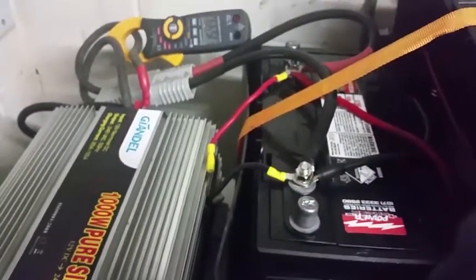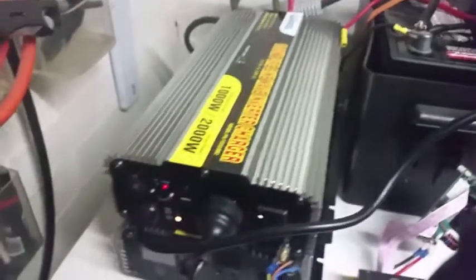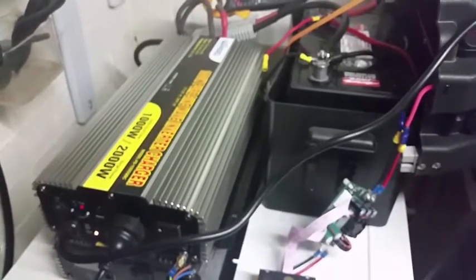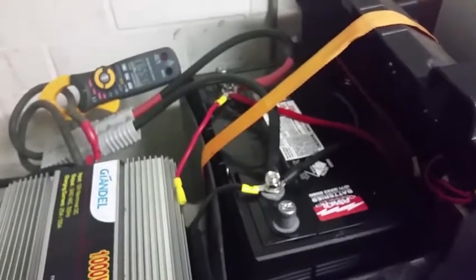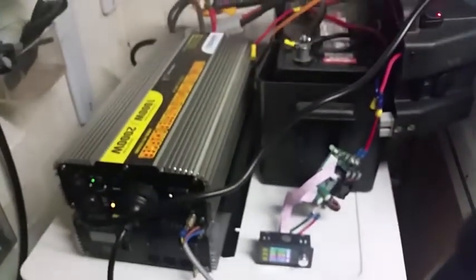So basically that's how the uninterruptible power supply works: power goes off, battery takes the load, power comes back on, the inverter goes back into charge mode and tops the battery back up again. If the battery is of sufficient capacity, this setup will ensure that a fridge or a freezer should run for some time. This battery nominally is 100 amp hours; in practice it's only 50 amp hours. At something like 10 amps running, that should give you about five hours of operation. And this freezer, if it's already cold, obviously won't be running on 100% duty cycle, so I figure that will give me about seven hours on one battery for this little fridge. Fantastic — very happy.